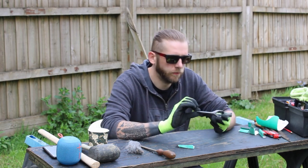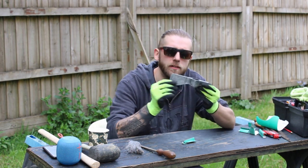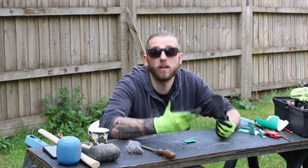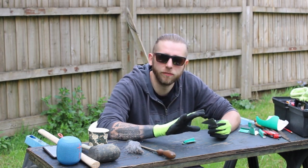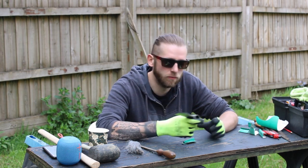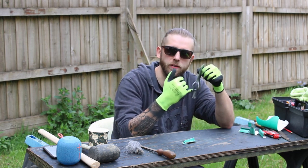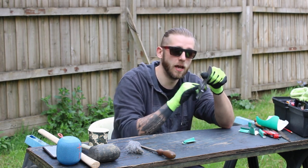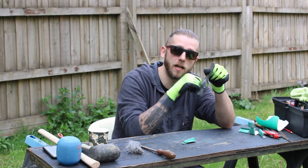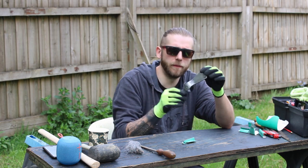I think I'm just about done sanding the head itself. Part of the reason I did this by hand was because I actually wanted to leave a little bit of the paint on in between the steel, so it looks a little bit more rustic and rough — rather than using industrial paint stripper and buffing the metal to a bright shine, which I didn't really want. What I'm going to do now is file the inside of the eye, as there's a load of sharp burrs which I need to take off. I haven't sanded the paint from inside the eye because it's going to be in the handle — you're not going to see it — so I'm just going to leave that and crack on with filing.